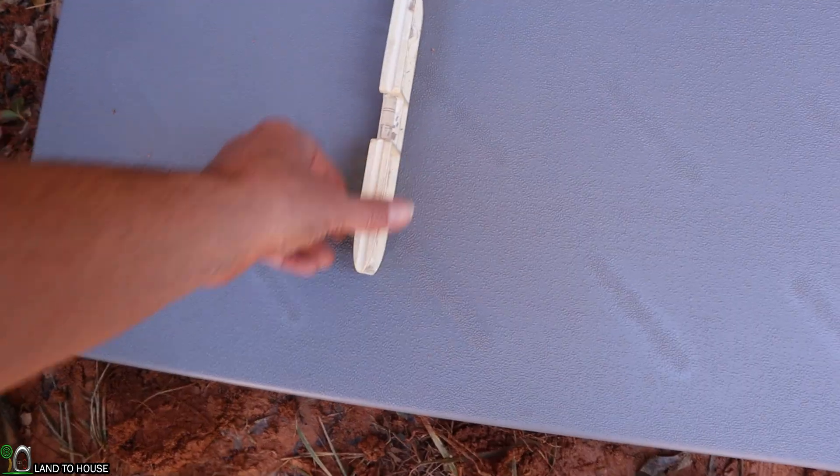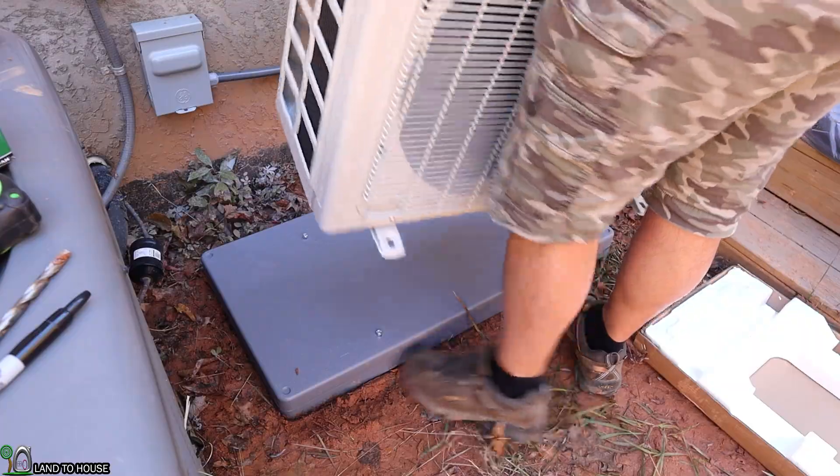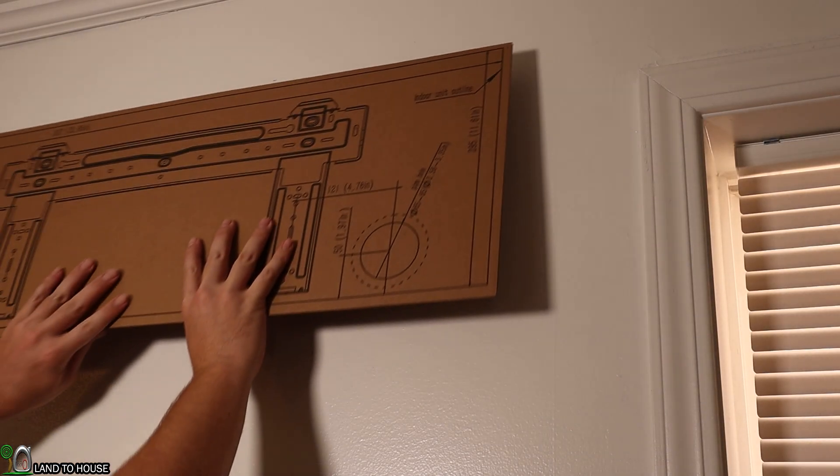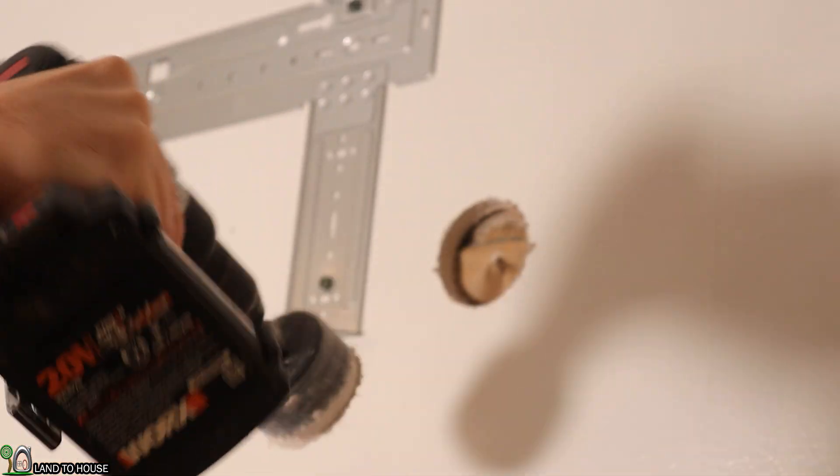Step one is to find a good place where you want to install the unit. It has to be within 16 feet of the indoor unit, so you want to find a good place for both — an open wall space inside and a place outside within 16 feet for the base. I started off with the base, leveled out the ground, put in a plastic platform, and bolted the unit to that. Once I had the outdoor unit installed properly, I went inside and had to drill a hole in the wall, which is probably the scariest part of the whole install.